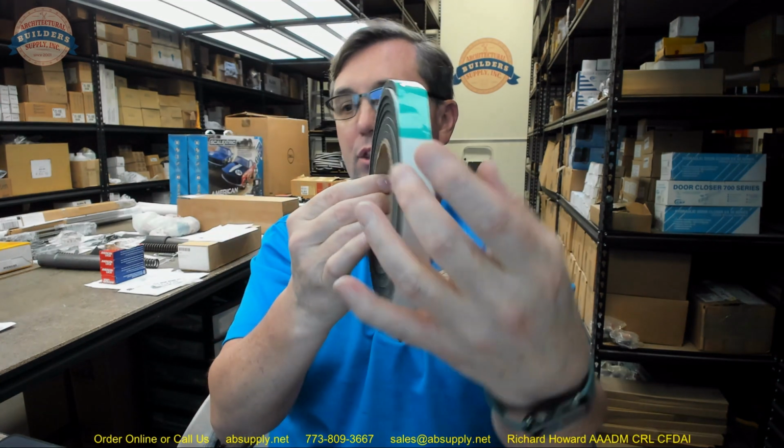Now, moving on, as we look at the extended description information down below: 3/16 by 3/4 inch, 10-foot roll of black. Resists deterioration from oily substances. Slightly compressible, self-adhesive weather stripping. It is certainly compressible, but it's still firm. It's not going to fold or completely close down like silicone would. So it's flexible, but still resilient. Durable and tough, I would say. Remains flexible at high and low temperatures. Superior product for weather stripping homes, cars, trucks, and boats. I've used it for trucks.